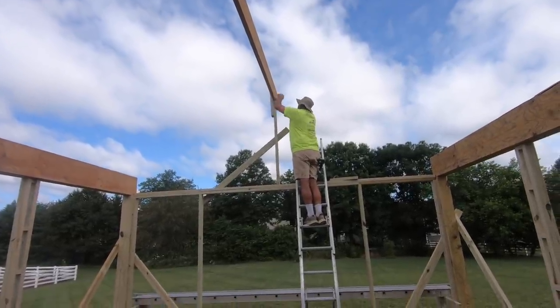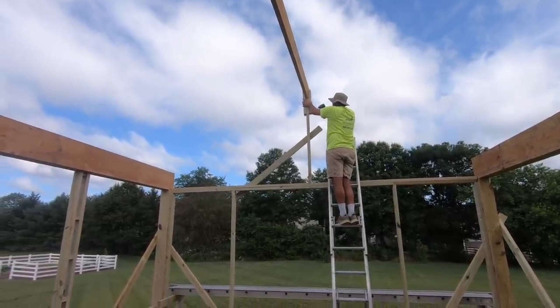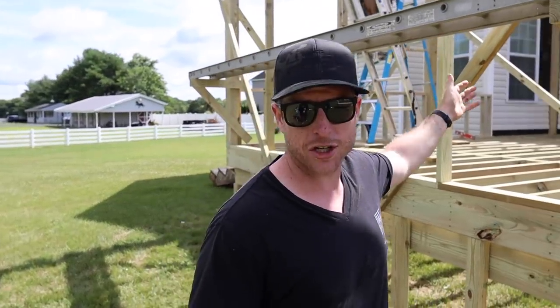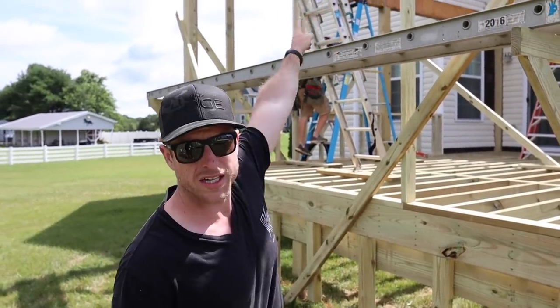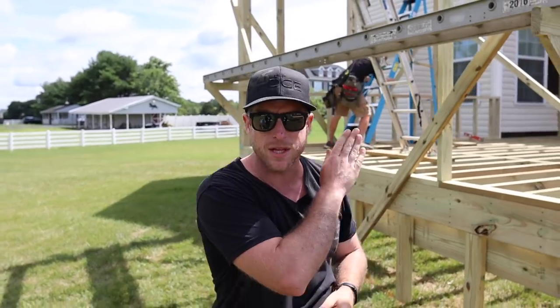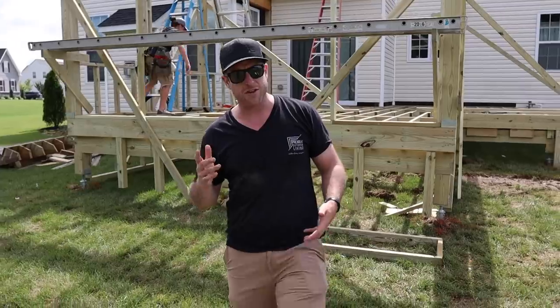We have our ridge up in the air. We've got this exterior wall here - it's going to be where the fireplace is, so we did a double top plate. You can see how we built that little U-shaped holder for our ridge, so that's going to keep it in place on this side while we're working. One thing that I really like to do is use an LVL for your ridge rafter. This is 28 feet long, so I don't like to splice those ridge rafters together with a traditional 20-foot 2x10, so this way we can get a full 28-foot piece.